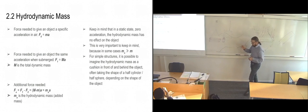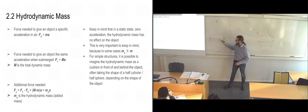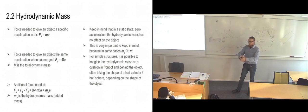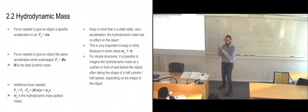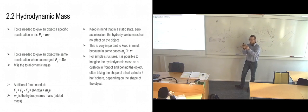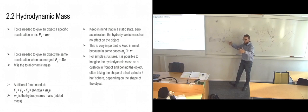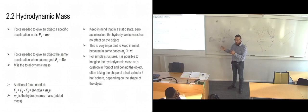We're going to look at basically the computer program dividing up the material in the pipe into many millions of parts, and it's going to do the basic statics and strength of materials calculations on every single part. Then it's going to transfer the results that it gets from the first part in the anchoring point here to the surrounding parts. It's going to calculate those, and then transfer those results to the surrounding parts, calculate those, and move on until it gets to the other end. And then you can actually see how much bend, how much sag there will be in the pipe and everything.